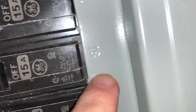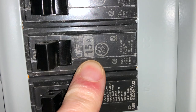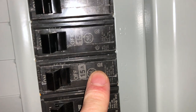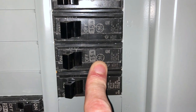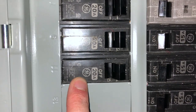If you don't know what kind of wire you need, look at your breaker panel. That GFCI is associated with breaker number 22, which is a 15-amp breaker — and a 15-amp breaker requires a 14-gauge wire. A 12-gauge wire is what you use with a 20-amp breaker. You can use 12-gauge on a 15-amp breaker since it's thicker and can support a higher load, but you do not want to use 14-gauge wire on a 20-amp breaker.